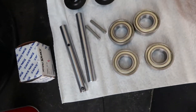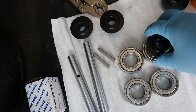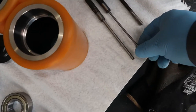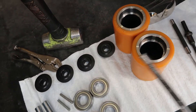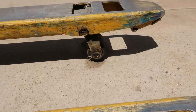I'm working on an electric Yale pallet jack. We're gonna be doing new bearings — don't forget to pack these. We got our new wheels, the caps for the bearings, new pins, new axles, and the grease is already in them. What you're gonna need is a couple punches, a good hammer, a pair of vice grips to hold these because you don't want to smash your fingers, safety glasses, and some good gloves. The axles are already soft so we can knock the pins out.